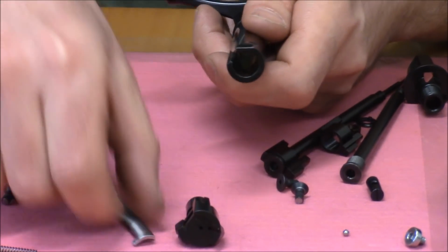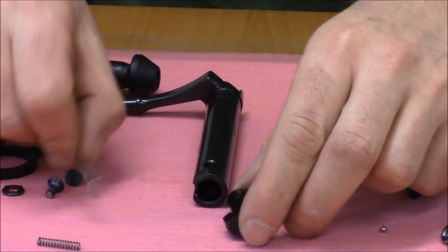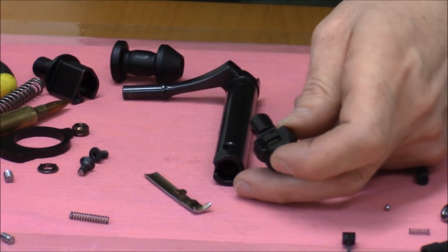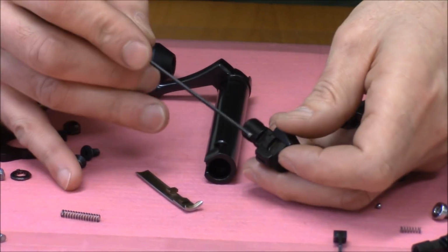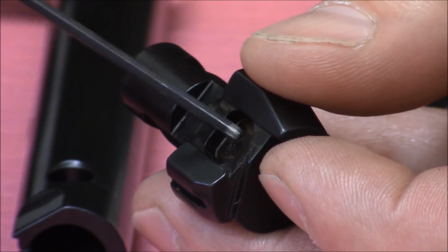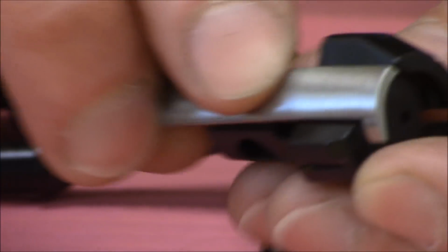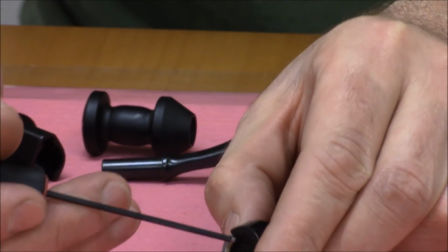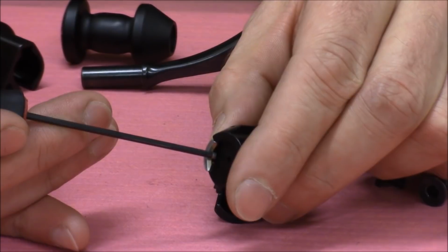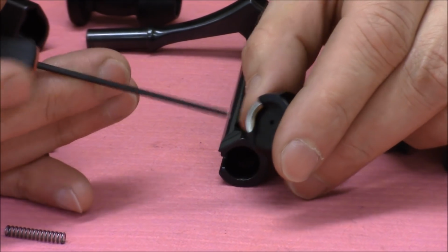There's a bolt head, an extractor, and a bolt, and they cooperate with one another to keep the extractor in the right place within the assembly. Now, the extractor and the bolt head: there's this forward surface right here in this pocket that's in the bolt head. It's undercut, and there's a lug right here on the extractor, the forward surface of which has a similar undercut, and those two undercuts will engage one another, right? And when they do, it prevents the extractor from moving radially outwards, basically it prevents the extractor from disengaging the case head by preventing its radial outward motion.